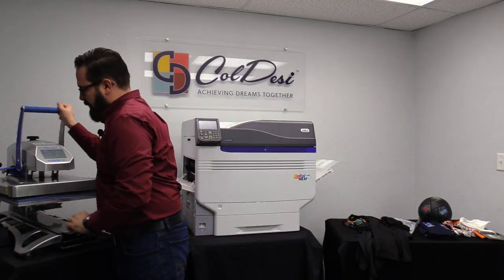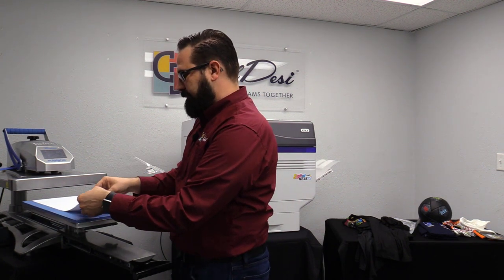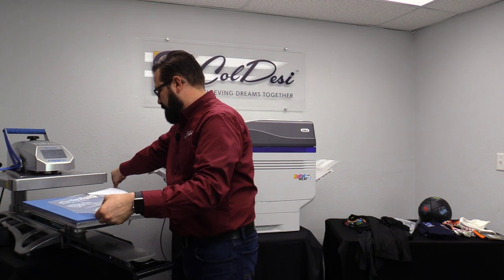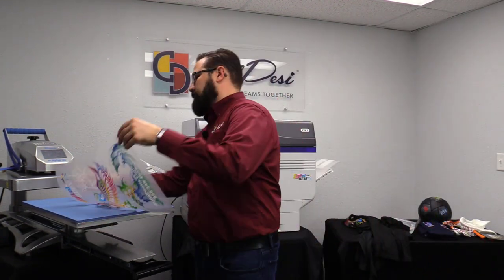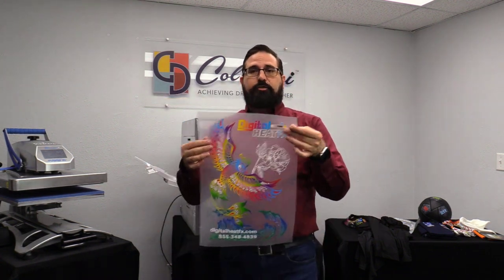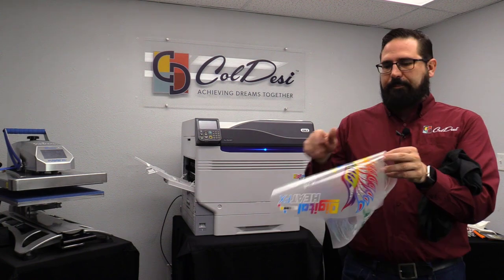Now we'll show the adhering step. We're going to open our heat press and put our paper aside. In a smooth motion we're going to separate the polymer sheet from the transfer sheet — we just pull it like this, keeping it warm as we go. And our transfer sheet is done. We end up with a transfer that's ready to be stored for later use, sold wholesale to someone who wants to purchase transfers, or applied right to the garment.